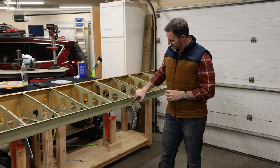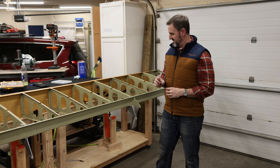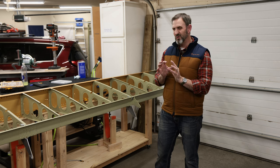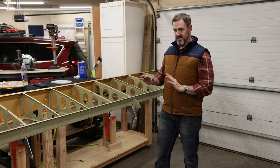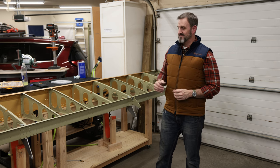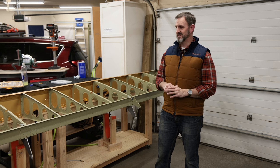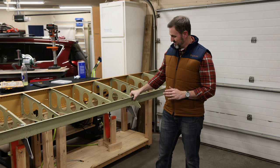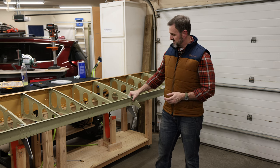But there is one rivet right here that's in a really thick part of the metal, and I couldn't have made a worse mistake. I drilled it out, and it was still within spec, but the hole got enlarged a little bit, and it's kind of ugly. I was able to put in another rivet, set it just fine, but it just drives me nuts. I mean, it's really aggravating. There's, I think, 18,000 rivets, something like that, on this airplane. They can't all be perfect, but I still have in my head this delusion, I guess, that every rivet I set is going to be perfect. And this one is probably going to be driving me crazy forever. Anyway, I got it set successfully.